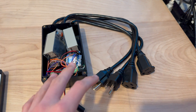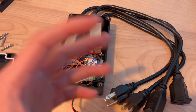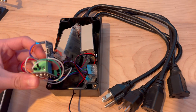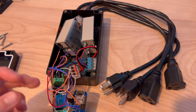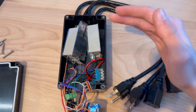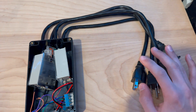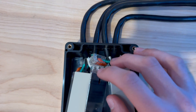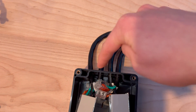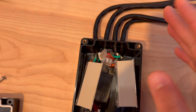Here is the teardown of the actual relay unit. This is not my finest work, but the purpose of this video is to show you the basic wiring diagram so you can understand it, do it yourself, or point out flaws in my wiring. Going basically from top down: these are the end connections that the client devices connect to. The grounds are connected and neutrals are connected for each pair, so there's nothing shared between these two pairs of wires — it's all isolated.